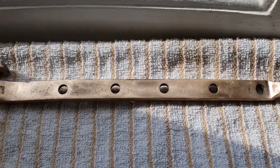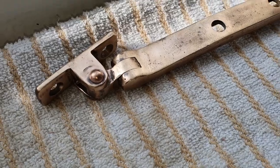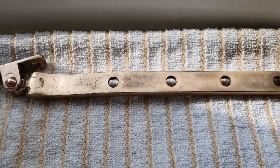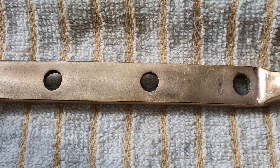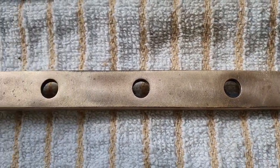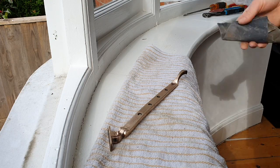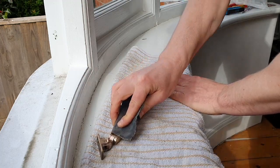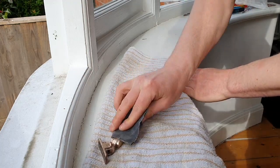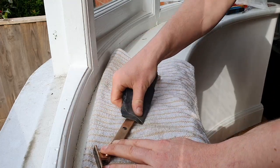So we've got all the paint off and it's starting to look quite nice and shiny. One final thing I like to do is use some wet and dry paper to just get rid of any marks that some of the sandpaper has left. I've got some 240 grit wet and dry paper here and I'm just going to give it all a rub down in the same direction, which will give it a nice brushed finish.